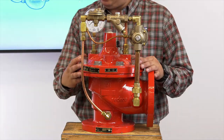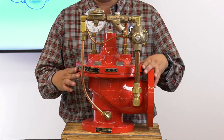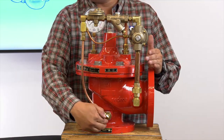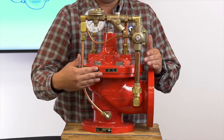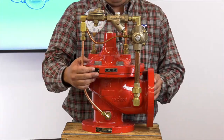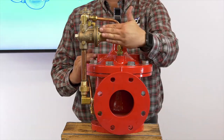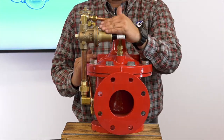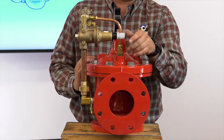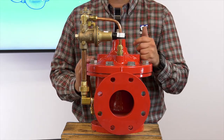Let's go through the startup procedure on our 50B-4KG1. The valve in front of me is our 2050B-4KG1 — an angle pattern main valve; that's the only difference between the two. If this is a new startup with a new valve, these pilots do come preset from the factory depending on the spring range — it could be 60, it could be 120, and so on. This is a 20 to 200 spring range, so it will be preset at 60.